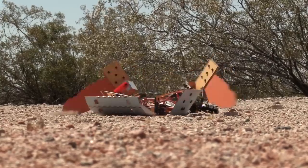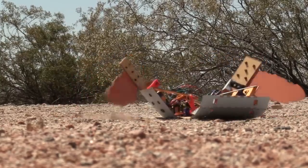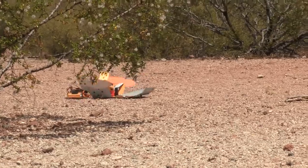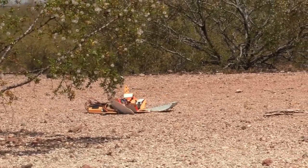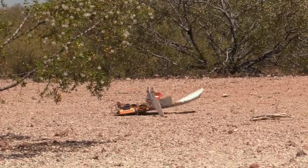The anterior end of the robot is curved dorsally to prevent the front end from digging into the substrate. However, the rest of the body is flat. Motion is achieved using paired four-bar mechanisms with two per fin, enabling each fin to move with two degrees of freedom. Each four-bar mechanism, in turn, is controlled by a single servo motor.